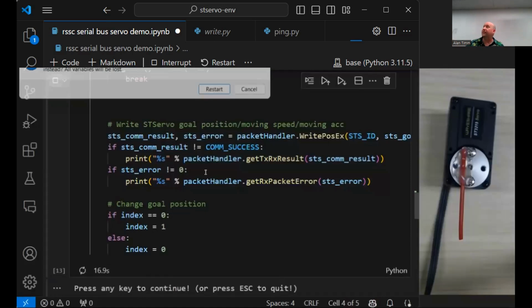The challenge is there's a lot of detail in here. And URDF models are generally very, very simple. So I need to find a way of simplifying the parts. Not that the computer can't render it, but there's no point where the graphics card could render 100 million polygons a second and make it look super awesome. The URDF STLs need to be vastly simpler. That's why I haven't figured it out yet.